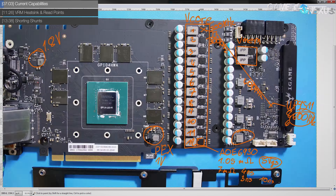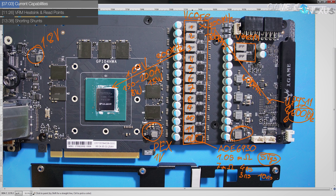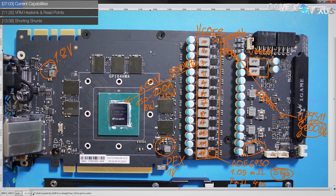The end result is that with this high-end MOSFET and the ridiculous phase count, this VRM is absolutely insane overkill for a GTX 1070 Ti. Under normal operating conditions, pushing the core to about 1.09 volts — the maximum voltage settable through Afterburner — you're looking at currents between 150 and 200 amps. At 300 kilohertz switching frequency and 5V gate-to-source voltage, 150A produces about 8 watts of heat and 200A about 13 watts — very, very efficient. Colorful has made a ridiculously capable VRM here.